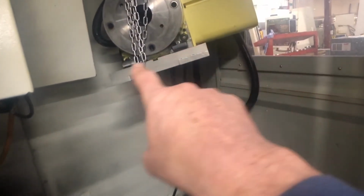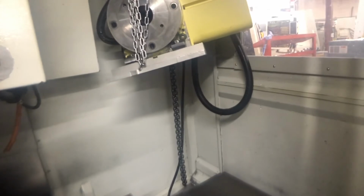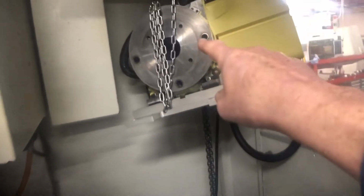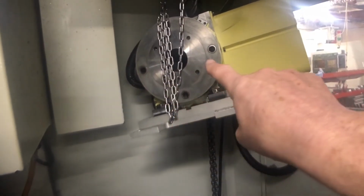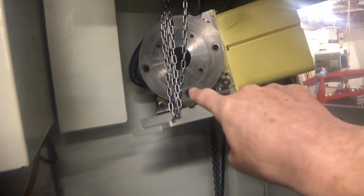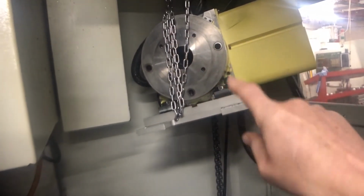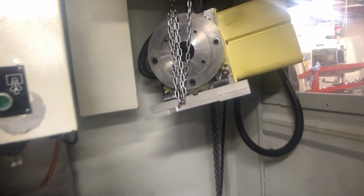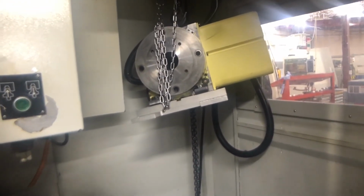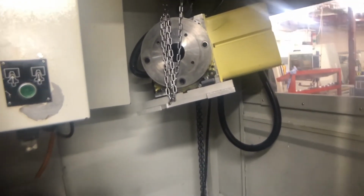4-axis has its own sub plate on. As you can see at the front of the 4-axis, that's the positions for the round sub plates. So you can see the 4 holes for the ball lock fittings. So if we're going to put a chuck on there, a collet chuck, we just put it on using the ball lock system.